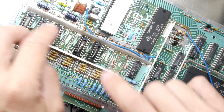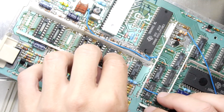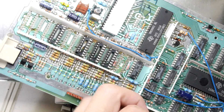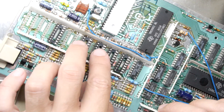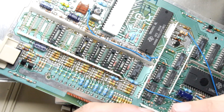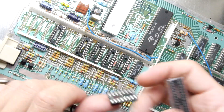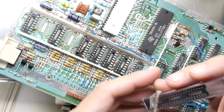I'm using quite cheap type of sockets here, so the pins can flop out. I do like turned pin sockets, although I've stopped using them because I get complaints when I make things with them. Turned pin sockets are way better. They might not be so easy to insert and remove, but why would you be inserting and removing? The reason they're difficult to remove is that they're designed so the chips will not work their way out of the socket. They are literally military grade.